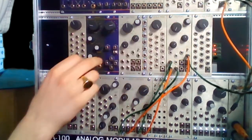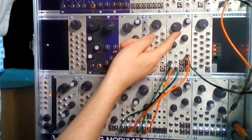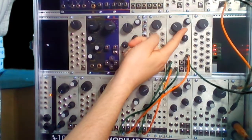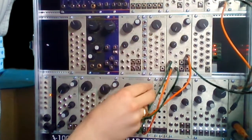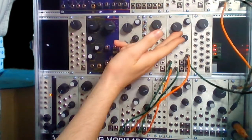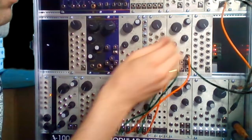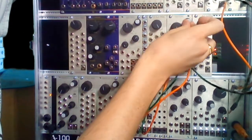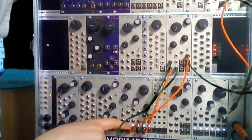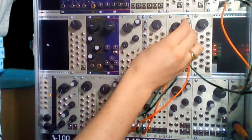And so this is without resonance. This is without the FM control. So we get, you know, some sounds. They're not super interesting. But as we now apply some FM, and this FM signal is the 2 out of here, we'll get some interesting effects as we tune.